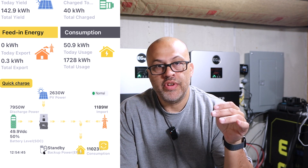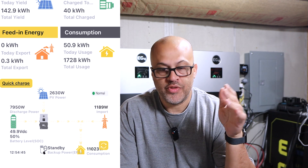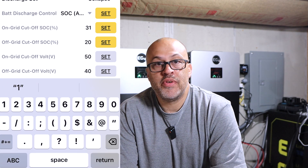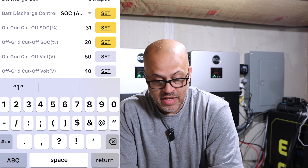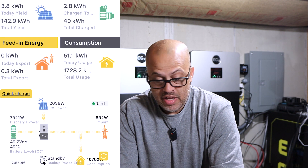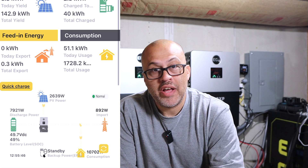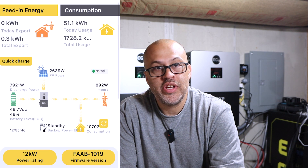Since you're only using one battery, you don't want to try to push 12 or 16,000 watts which is the surge capacity for the inverter. I regulated it down, got almost 8,000 watts coming out, and I just want to show you guys that 8,000 watts will come out of that one battery - you can set the discharge amps to whatever you want, no problem. Having about 10,000 watts coming out of the inverter off just the one battery - I think that's pretty good. This inverter has all kinds of features the 6000 XP definitely doesn't have, and I'd still recommend it.